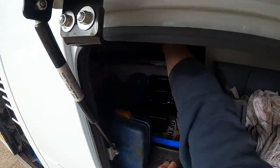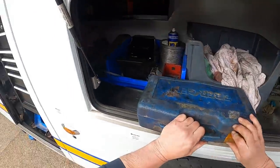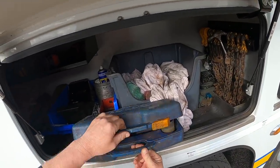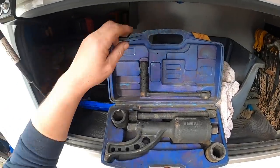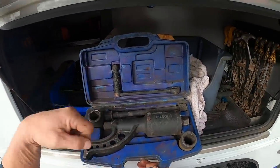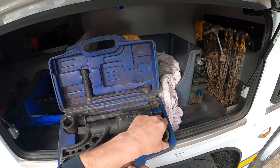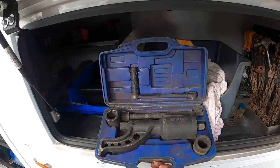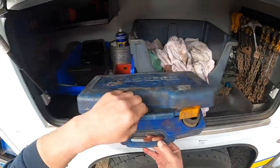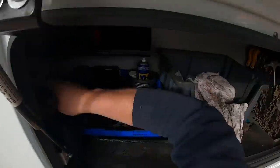Maybe a stubby half inch is on the shopping list next. In conjunction with removing truck wheels, I've got a torque multiplier - added years ago, don't use it very much but very handy. It fits together and you just wind it old-fashioned style and it undoes - just nips the wheels off, just does the breaking bit. If you can't do it with a three-quarter gun to start with, this will just get the tension off and then you wind them off.